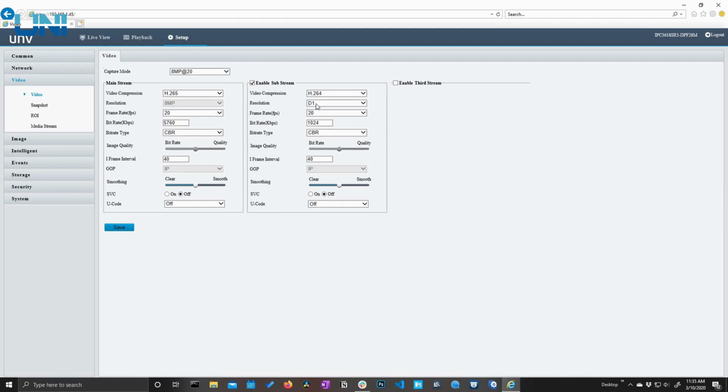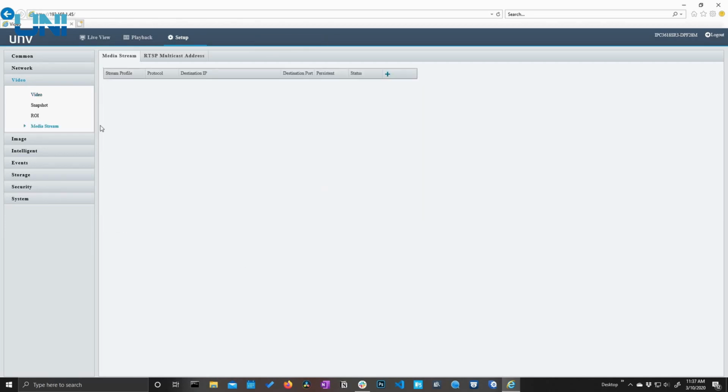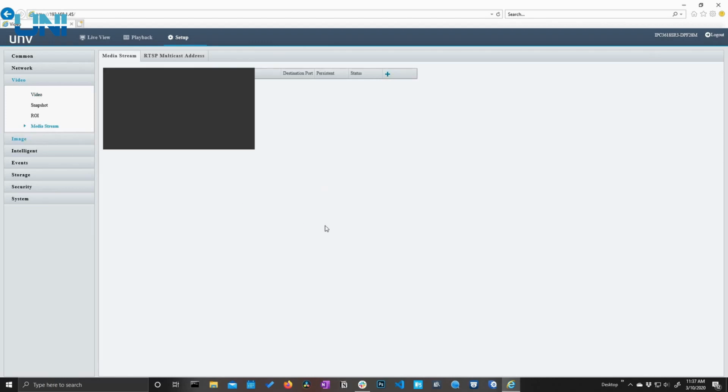Now for our sub stream, I don't want this to be D1. I want this to be 1080p. So we can set that. We'll keep the video compression for the sub stream at 264. Frame rate at 1080p actually goes down to 15 frames per second, which is fine. This is just our sub stream. I'm happy with that, so I'm going to hit save. And now let's jump into the image settings.